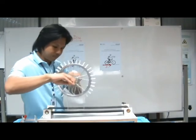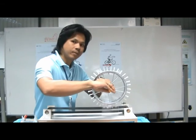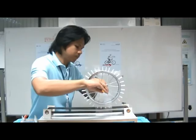The non-driven wheel is rotated when being pushed by the handle connected to the wheel's axle. When the handle is pushed to the right, the wheel rotates clockwise. The frictional force between the upper surface of the rubber belt and the bristle tips causes a rotation. The bristle tips move to the left-hand side with the rotating wheel as a result of the frictional force.